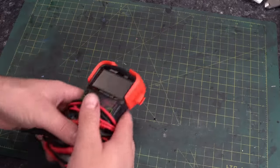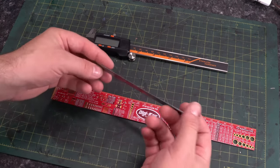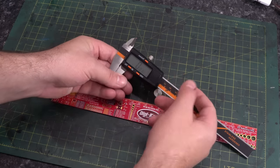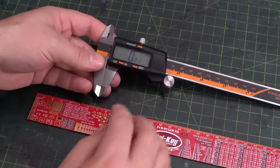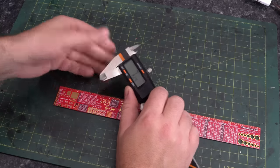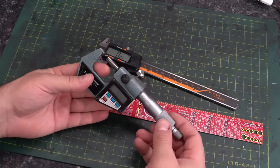As always, buy what you think you need. A good scale not only is usually rigid, it allows you to check flatness of things, measure things in a straight line, and make sure it's easily legible. Something that goes down to millimeters — even a small one like this — is good to keep on hand. A little bit more precise is your digital caliper vernier. I like digital mainly for the fact that you can switch between inches and metric. I live in one of those parts of the world that still uses both. Digital is good enough for what we're doing. Try to avoid getting the plastic ones — they tend to wear out. Really good ones like Mitutoyos last longer. These cheap ones tend to drain batteries, but for 3D printing work, really any except the absolute bargain bin ones are good enough. You don't need micrometers or anything like that.